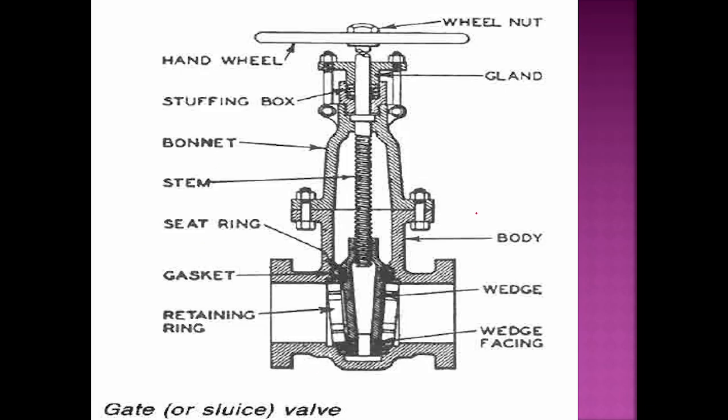If you want to do the overhauling of this gate valve, first you close the valve. After that, remove the bonnet and you can separate the bonnet from the body. When you take out the bonnet — as I said, close the valve first — along with the stem, the valve will come out. Then rotating it anti-clockwise, you can separate the stem and the valve. You have to check the retaining ring, the valve seat, the valve, and the condition of the threads, and after that you can box back.